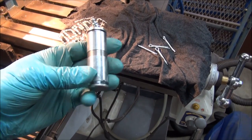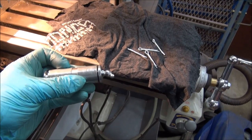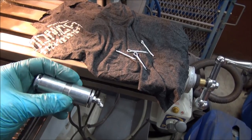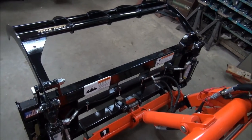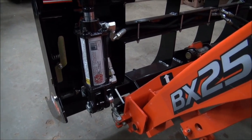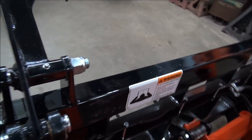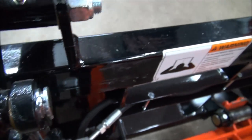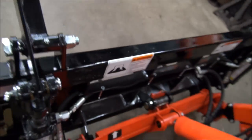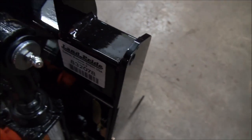That's one pin done. That's how it's going to look. The regular cotter pin that they had will go on the inside and the grease nipple will go on the outside with the c-clip holding it in. I got four to six done. I don't think I'm going to bother with the bottom ones because there's very little movement there so there's really nothing to wear. The top ones are done — you can see the grease coming out, and there's a lot of movement up there. You can see the grease nipples as well. That's the furnace making a lot of noise — it's blowing off steam.